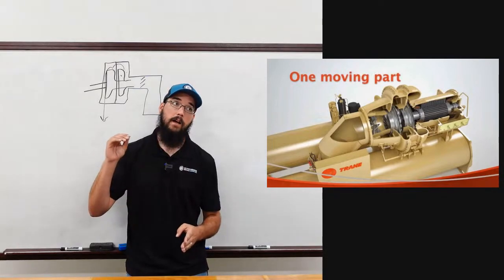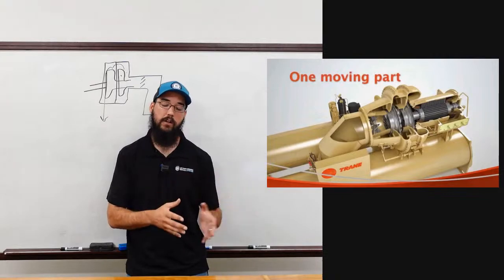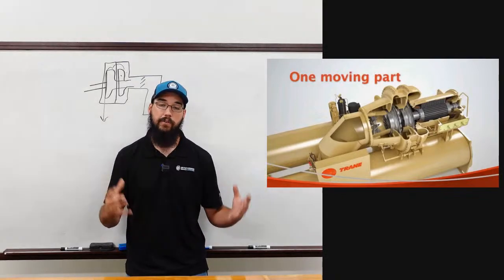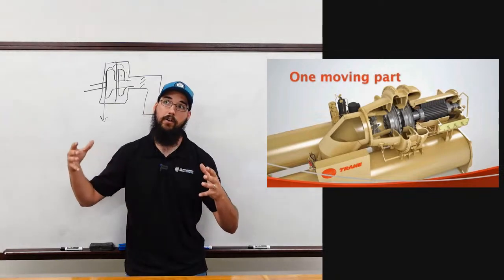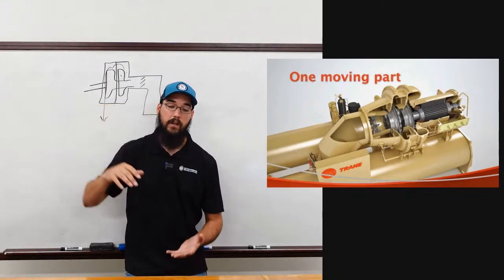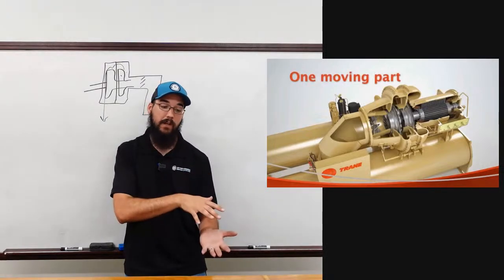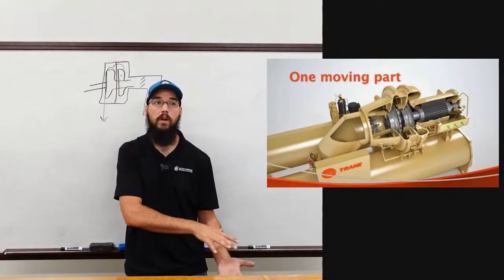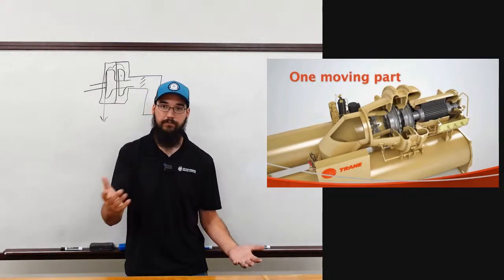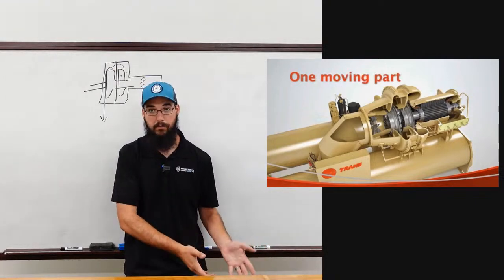Anyway, they can get non-condensables in there. When you have those non-condensables, that's going to affect your ability to heat exchange, and that will lead to higher lift ratios. At the same time, if you're running really low chill water set points,